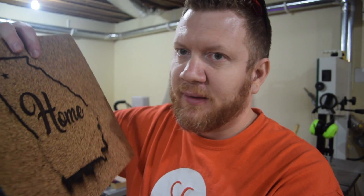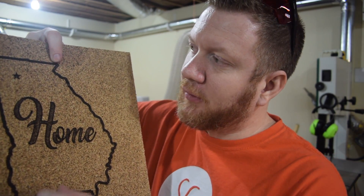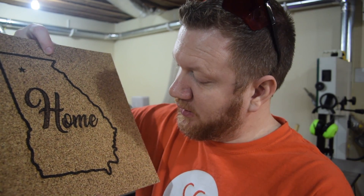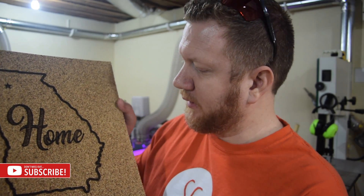— which still got flare-ups. So I decided to go back and try it at 200 inches per minute, and that's where we started seeing some really finer lines. And then I concluded it with 200 inches per minute with a 0.03 stepover, and this is what we get here, and it just looks gorgeous. Maybe just a hair of a flare-up from time to time, but all in all, I think this is the right setting for the cork, this kind of cork.